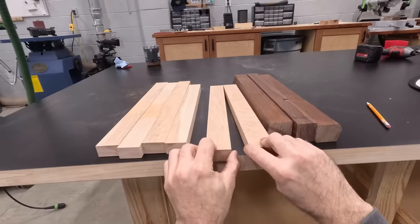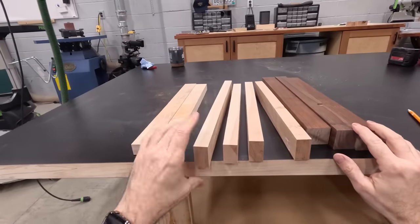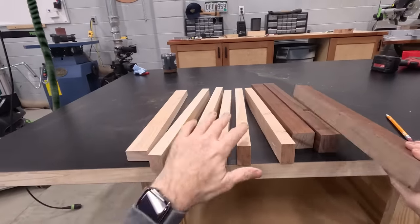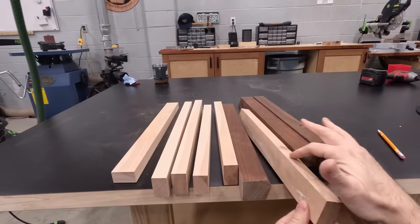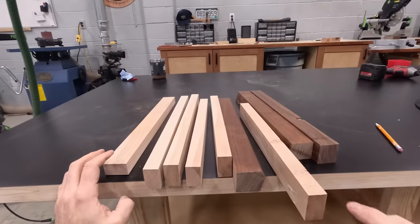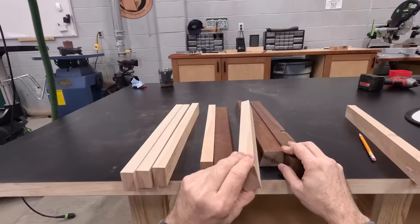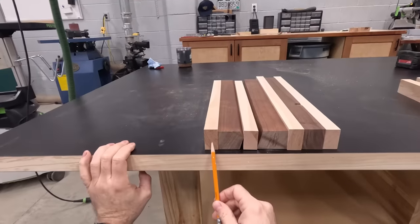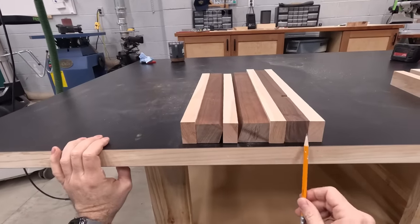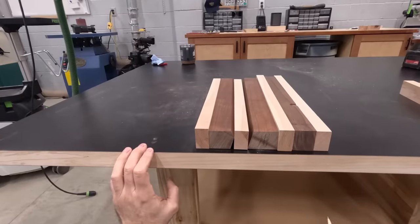Check this out — that grain can all go vertical and we could start to alternate these pieces and see what we can come up with. That piece looks pretty gnarly; we'll probably clean that up, but I think we might have one extra piece so it's fine if that one doesn't get included. You can see we've got all vertical grain here, and of course these pieces need a little bit more work, so we're going to do some jointing and planing.